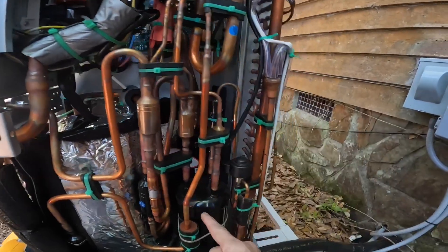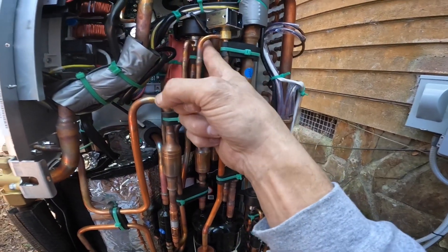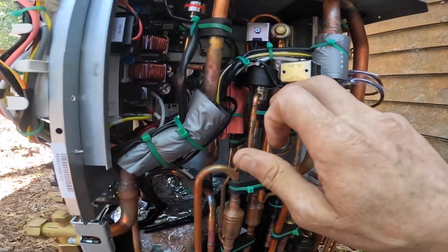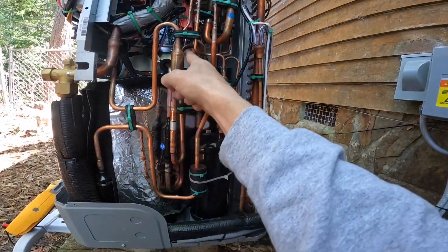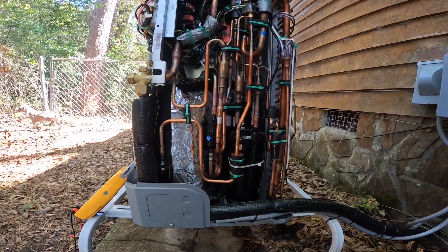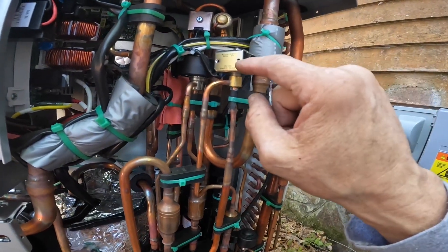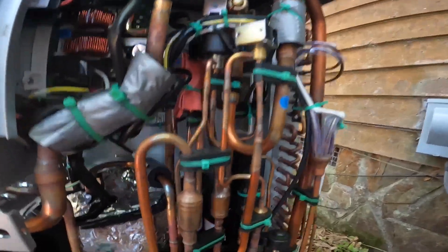And it looks like this one is my metering device in cooling. I could be wrong, but I think that's what that is. This is the one that adds sub-cooling — it's not technically the metering device, because some of this looks like it just bypasses straight through on my liquid line. This adds sub-cooling and there's a TXV on the inside, but this one is for my hot gas — at least I think that's right, if I'm wrong let me know.